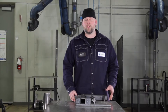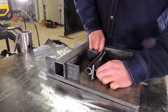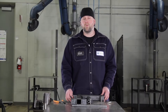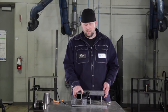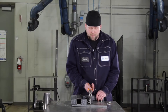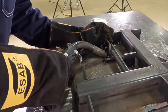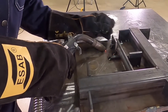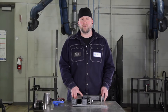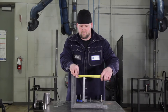Once you've got your jig built, it's important to make sure that it works and that it's easy to use. I'm trying to pull out this bolt here which lined up my hole, and I can tell it's really tight, so I'm going to have to rework this a little bit so the jig works and the part is easy to take out. I had an issue with this hole — what I'm going to do is pull off this tab and reload.